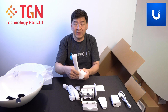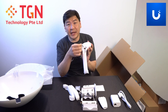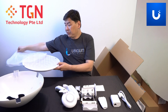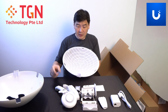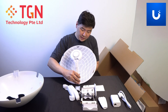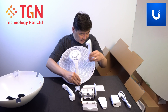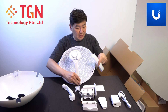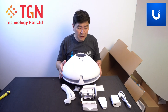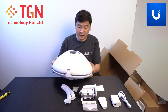Now we have the radio. This is where you open it up and have access to the gigabit port, where your LAN cable will go through the arm after removing the protective cover. You then mount this on the dish and clip it in. I'm not going to do that because it's going to be very hard to take out later on. You secure the sides with the two side arms, and the snow dome goes on top — it's going to look something like this.